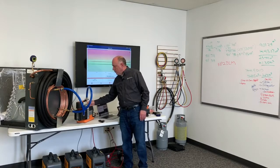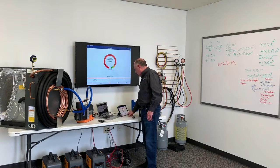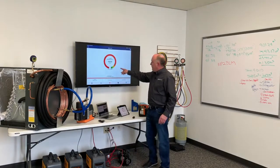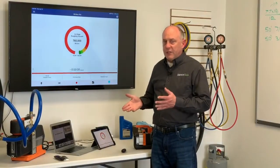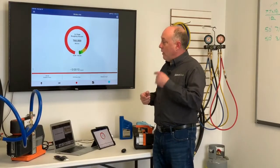We'll go ahead and do a pull down here, and let me show you how fast we can do this. I'm going to go back here and restart the recording, and then I'll kick on the pump. So we're at 760,000 microns. We're at atmospheric pressure here. The pump is a DC pump, so it's got a soft start. You heard that start a few seconds after I did the switch. That's getting up and running here.